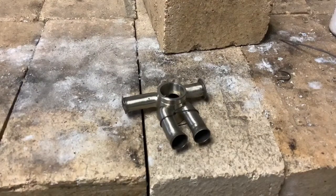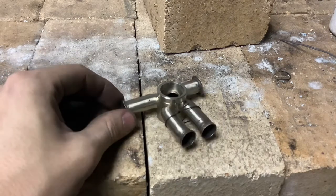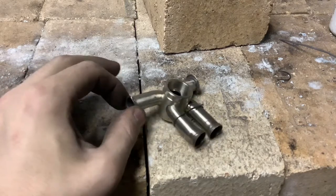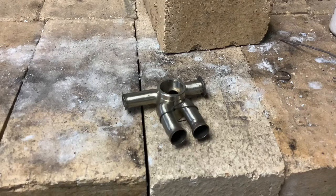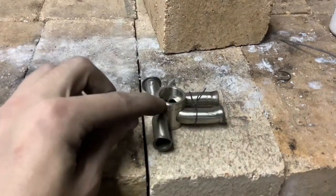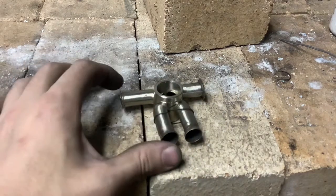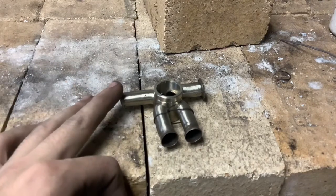Since the balling-out process, I've just sanded the crooks and the casing. If you ever make valves and skip sanding the crooks before brazing them in, you'll really hate yourself when you finish the valve. When you go to buff it and you see the machining lines, then you have to get in and sand away parting lines. Have fun trying to sand the face of that rotor after you've brazed it in — it's just not going to happen, and if you buff too hard you'll make it look ugly.